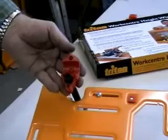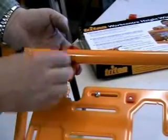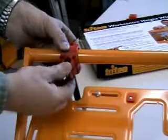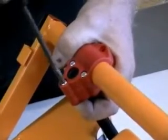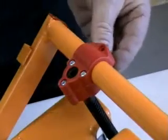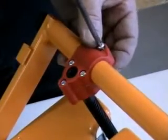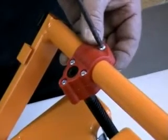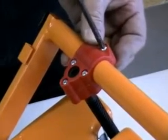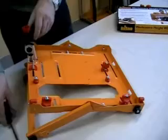Now join the U-frame to the height winder assembly by connecting the red plastic top saddle to the matching bottom saddle with the 3 30mm M4 screws and nyloc nuts and a shorter 25mm M4 screw in the outermost position. The 3 longer screws are fully tightened, but the shorter screw is only gently tightened so that the saddle does not bind on the U-frame. Ensure the orientation is correct by comparing the instructions carefully. Then check all fixings and using the key, check the ease of operation.